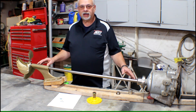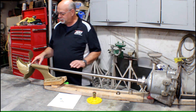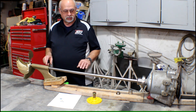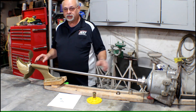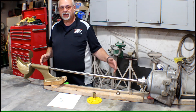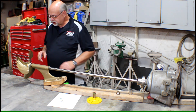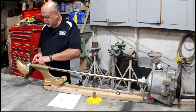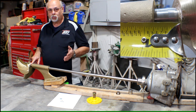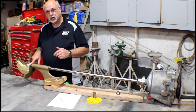Now the length of the shaft is the next step. The key to this is the gap between the propeller and the strut. This is why we sometimes ask you to measure the shaft length without the shaft at all — just measuring the boat. Quite often we find if a caller says they've removed their shaft, measured it, and want one just like that, it turns out that was not the correct shaft to begin with. The goal is to have a three quarter inch gap between the end of your strut and the back of the propeller. Three quarter is the goal — one inch is maximum, half inch is minimum. Three quarter is the sweet spot.